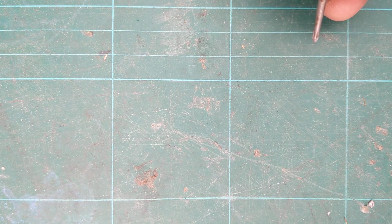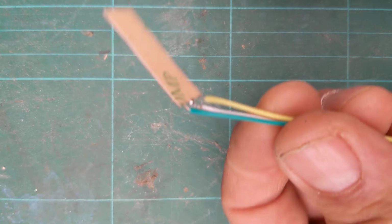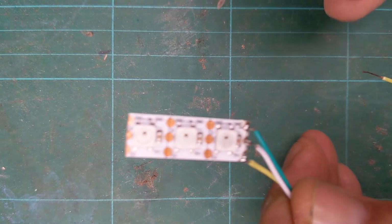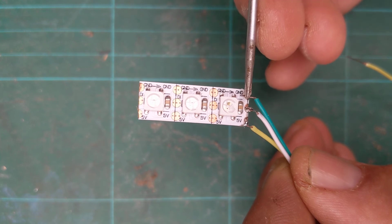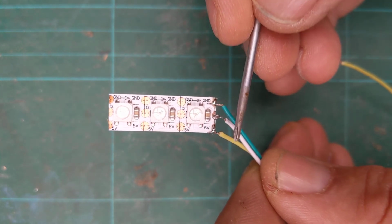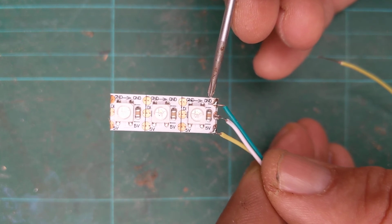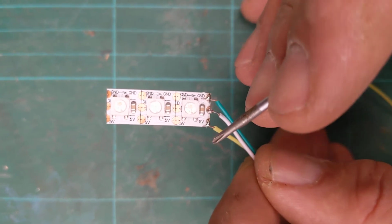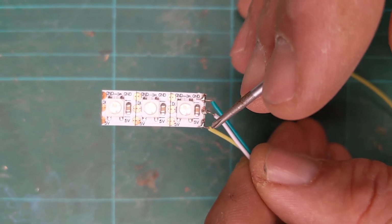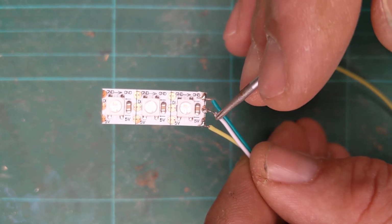And then lastly, you could come to these. Now this is an adhesive backed zip LED. You can cut these to be any size you want, so I can use them individually if I want to. There's your 3 wires. So I've got power, if you can see there. Oh, one second, that's GND. So that's my minus, the green one. And on the left hand side there, you can see it says 5V. So that's my plus power. And the middle one is my signal.